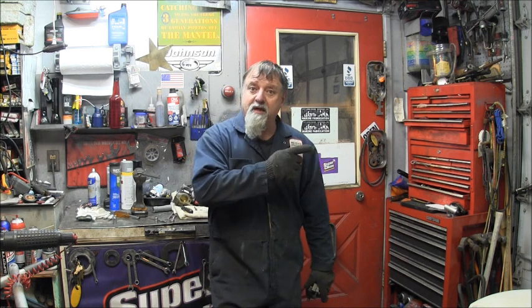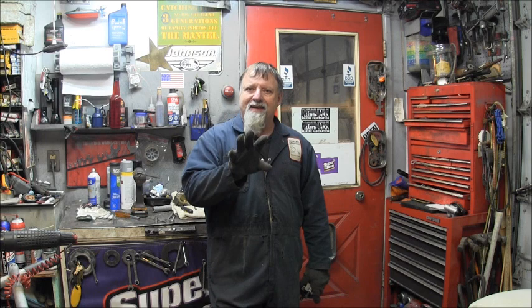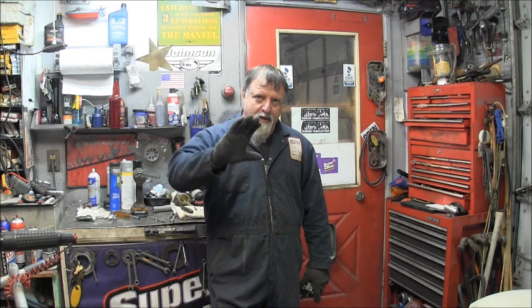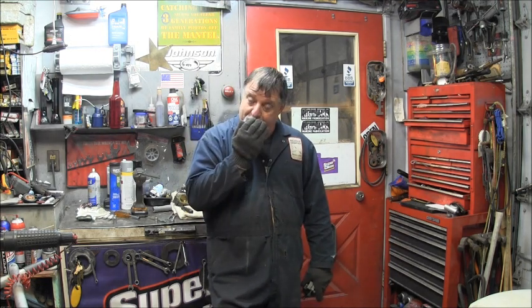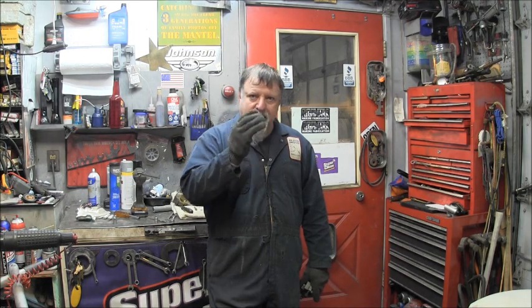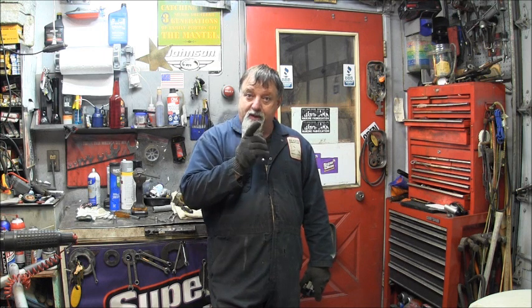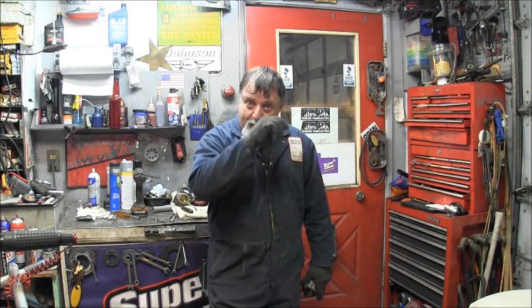Yeah, I was working on the 70 three-cylinder two-stroke Mercury with VRO. And I had to do some stuff around the intake on it. And I put a little sealer on a gasket that was on the carburetor side of the intake cover for that motor. And I told you the manuals say, no. If it's from the reed valves or the intake forward to the carburetor, you don't use sealer. That's what the manuals say. Except for one, there was one exception to that that I could find.